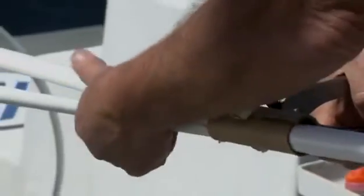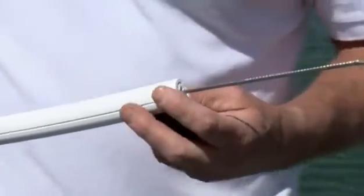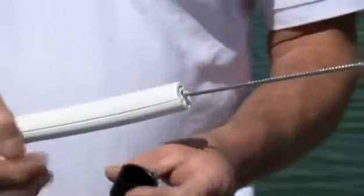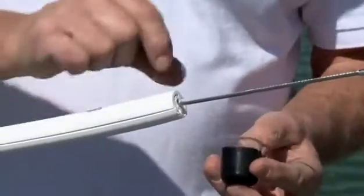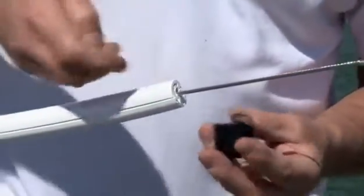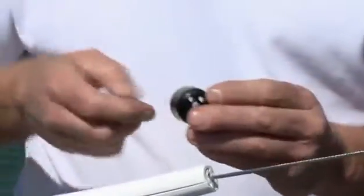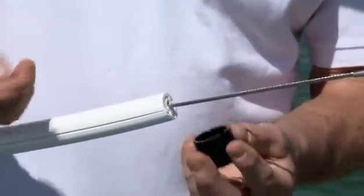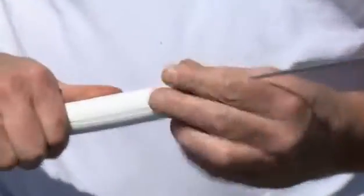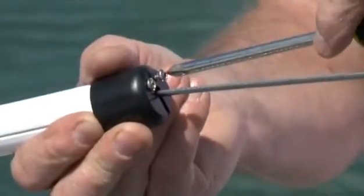Then we'll come back and put the top cap on the top of the extrusion. Once we have 36 inches of the foil snapped together at the top, we add the top cap. This is a plastic cap that goes over the foil and secures with two screws. The two screws go down into the front foil, and it simply snaps on. It goes over the top of the foil and we secure the two fasteners down the top of the system.